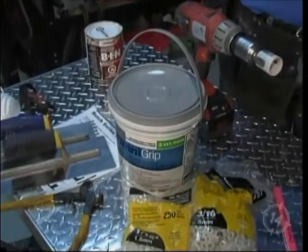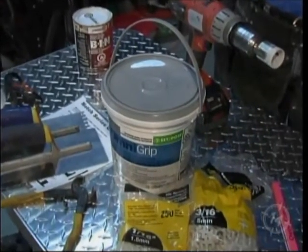I don't care what the manufacturer tells you — if you're tiling above your bathtub or in your shower stall, use thinset and thinset only. Thinset has concrete properties in it, Portland cement. That's going to give you the strength and a waterproof installation. For any floor application, you want strong tile bond — you want thinset.